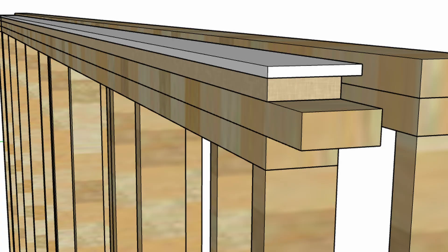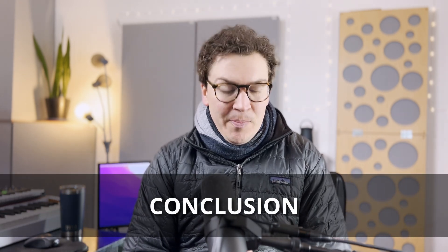In essence, that is the idea of how to build the fire stop and keep isolation. Looking at this perspective view in my CAD file, this is a continuous system that goes across all the tops of all four walls in your studio room so that fire can't spread to the ceiling easily. It will make your system and your room a lot safer. Remember you can use rock wool or thermofiber — any insulation batt with good density so it can maintain its structure — and make sure to use fire caulk and ensure it's sealing that air gap so fire and smoke cannot travel up through the wall cavity.